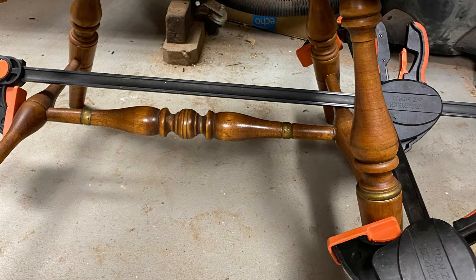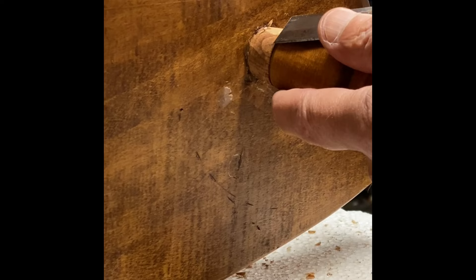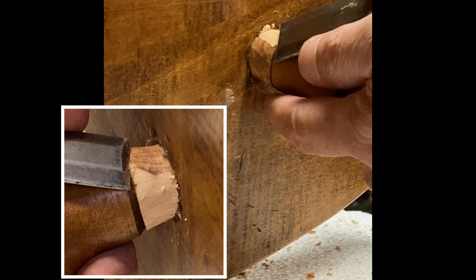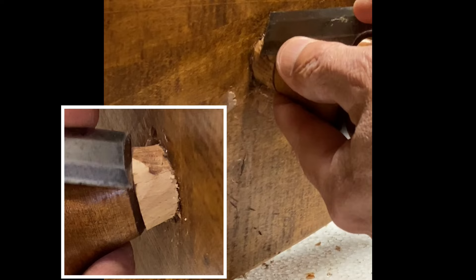The glue is complete. We'll now use a chisel to hone back the end of the dowel to match the other three legs of the chair, do a touch-up with some stain, and then get this chair back to the customer. If you have any questions on the process or methods used in this repair or any of our repairs, please comment below. Like, subscribe, and as always, thank you for tuning in to AG Johnson & Son Furniture Restoration.